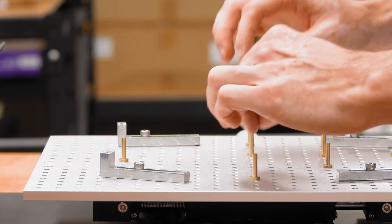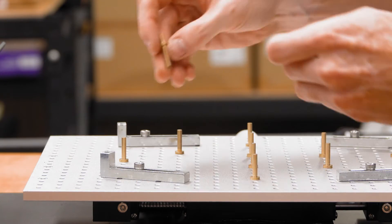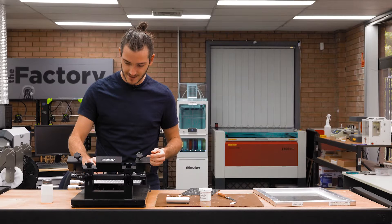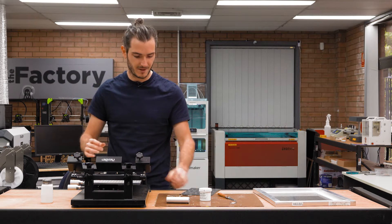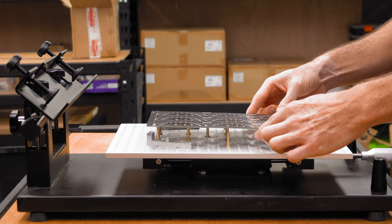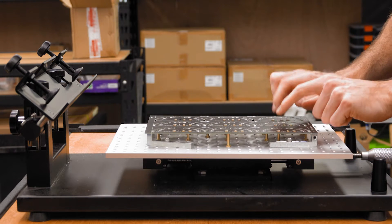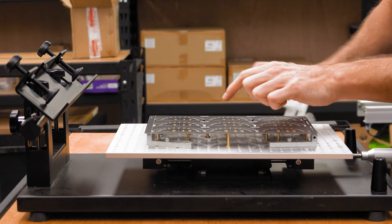We have quite a lot of pins so we can provide a fair bit of support. I have seen online that some people use a machined piece of aluminium billet just as a large block to sit in the space of the panel, so you don't have to place these pins — that might be something for us to look into. I like to perform a little tap test just to make sure each individual PCB has adequate support.